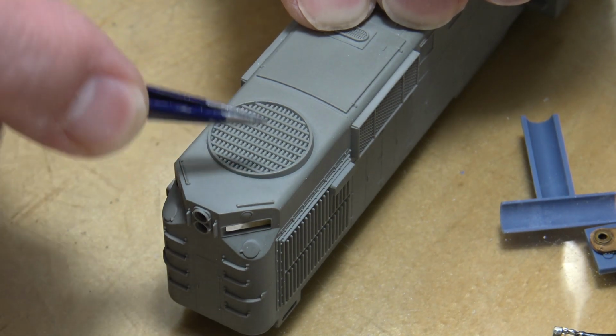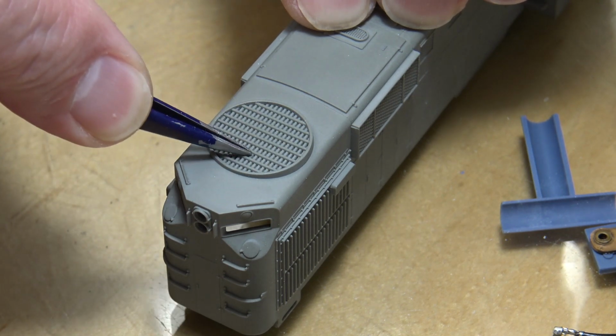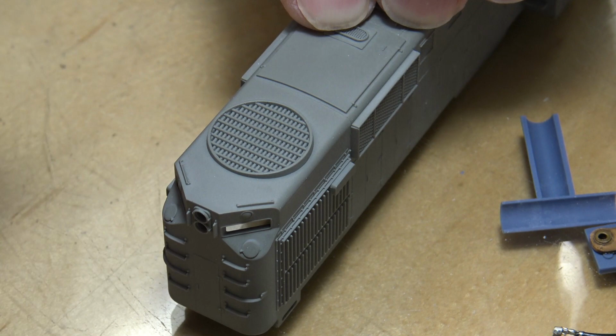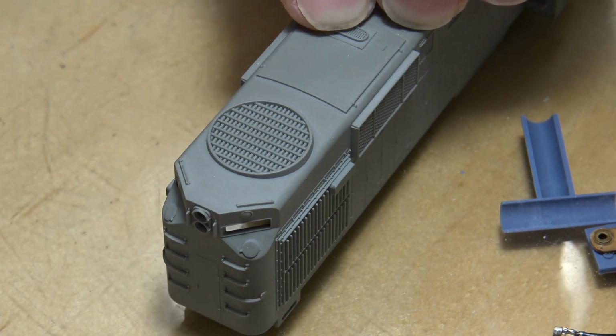0.625, and then I'll make another ring gauge that goes in here that has a hole in it that I can trim it out to. I need to bring it up to like 40 thousandths, I think it is, because 1/32 is about 31 thousandths. So I just need to get it in that range and cut this out, and then I can just ream it right down in.